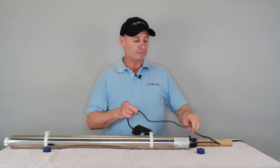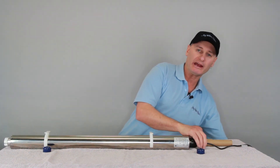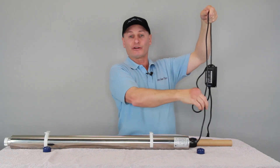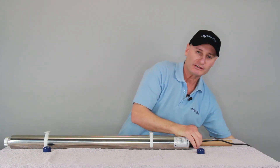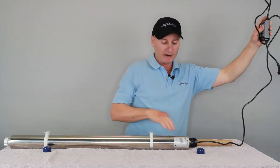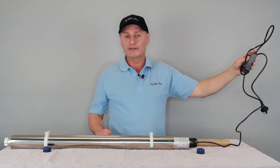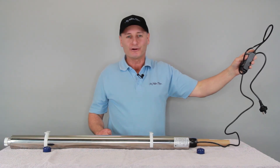Now, last important thing. When the wire comes out of the UV, the cord's got to go down so the condensation runs down. You can't install it going up — in winter, condensation will get on the lead and run down into the end of the light. So come out of the light and take it down. It can just dip down and then go up to the power point, but it's got to drop down when it comes out of the light. And that's it — you've just put your UV together. Good luck to you, and I'm sure it'll look after you well. Thank you.